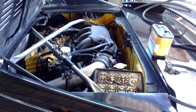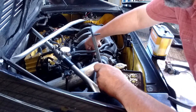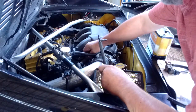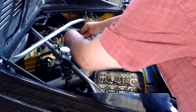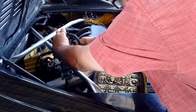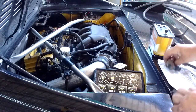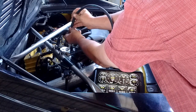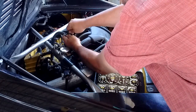I'm going to show you how that works. First, I'm going to turn the engine off to install this. To put this in place, I'm going to take a little piece of hose with a tee. I'm going to disconnect this hose off of the throttle body and take it right off. Put this onto the tee, clamp it on, and feed this into the throttle body nipple. Now I'm going to take this VSV and put it into the other branch of the tee, making sure it's nice and tight.